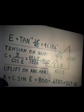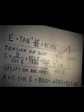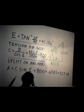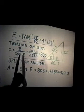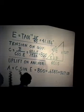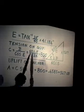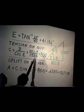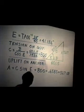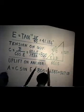You can do those calculations on your $2,000 computer, or on a little TI-30 that I bought 15 years ago for $7, or you can look up the things in the trig table and divide it out by hand. There are all kinds of ways of getting these answers. The tension on the guy cable will be V divided by the cosine of E — that's 601.5 over 0.7526, or 800 pounds.